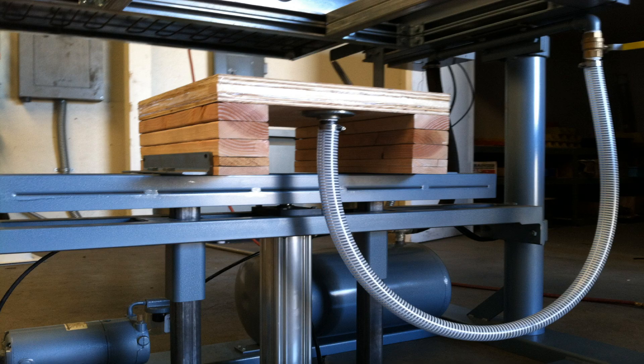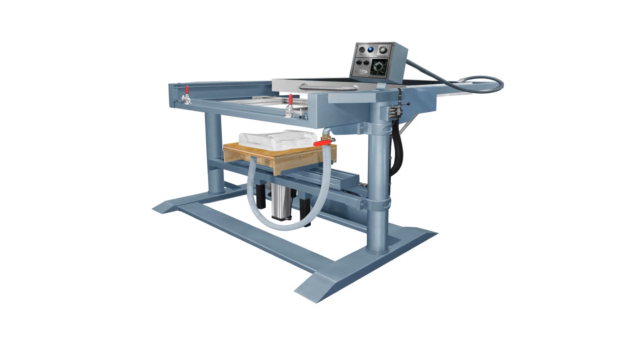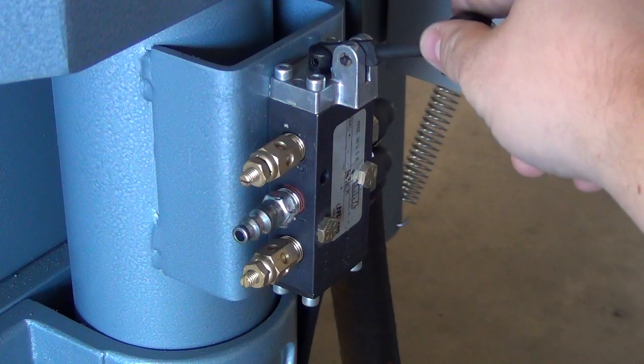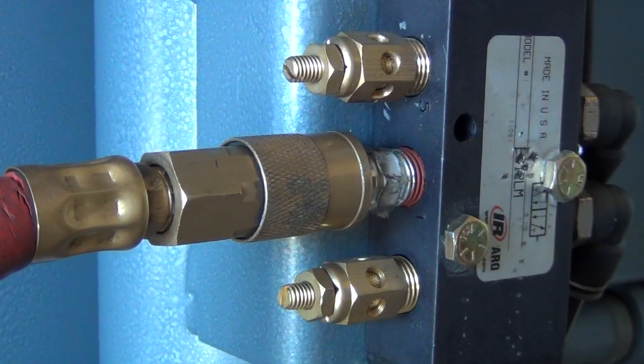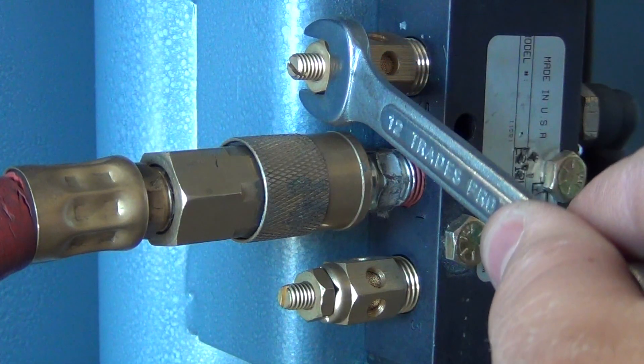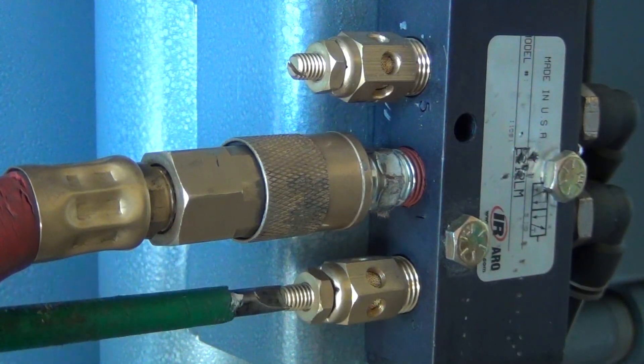The piston driven steel mounting platform underneath the clamping frame, also referred to as a table, is used to secure and deliver the vacuum box into the plastic. It is shown here with a 19 inch by 19 inch vacuum box installed. The black valve located on the right hand side of the machine is used to raise and lower the table. The speed of the table can be increased or reduced by adjusting the set screws in the brass mufflers located on the left hand side of the valve.